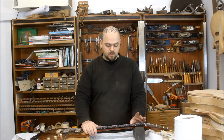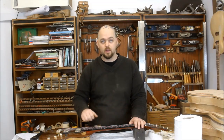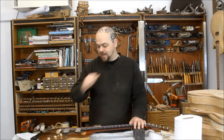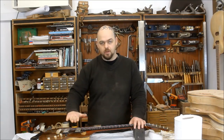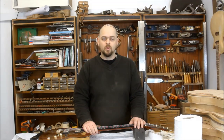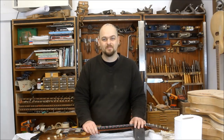I have used heat, i.e. I've warmed up the fretboard like that with an iron, or a lump of steel that was warmed up and then just put on it, because I didn't have an iron that day. And I have heated up knives or paint scraper type things and put them underneath and slowly wedged it that way. The problem with that is if you get the grain the wrong way, you can rip the hell out of everything and just ruin your guitar, basically.